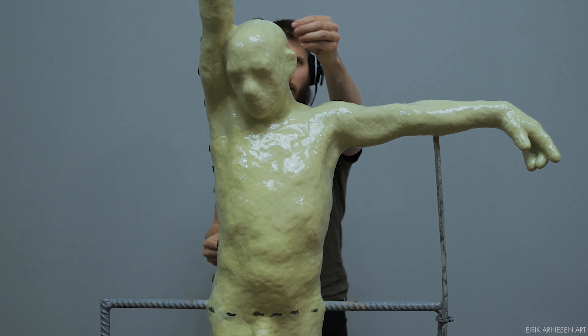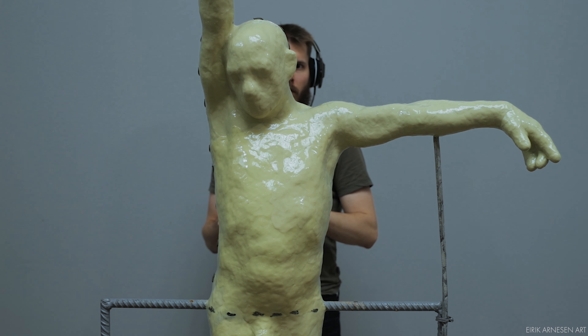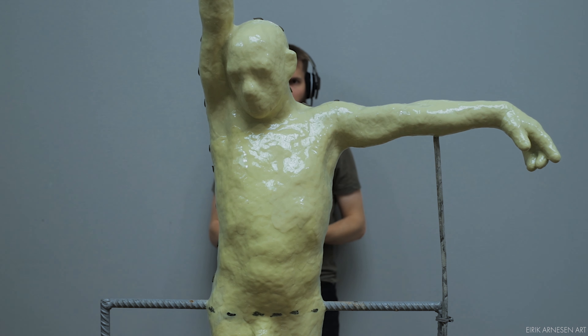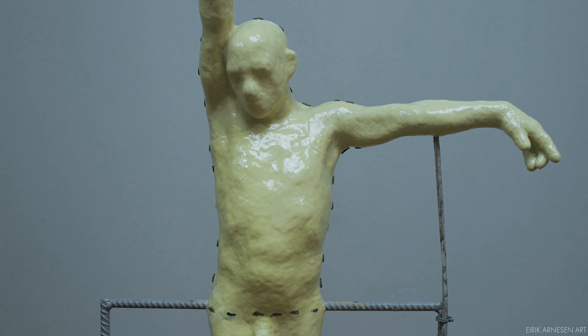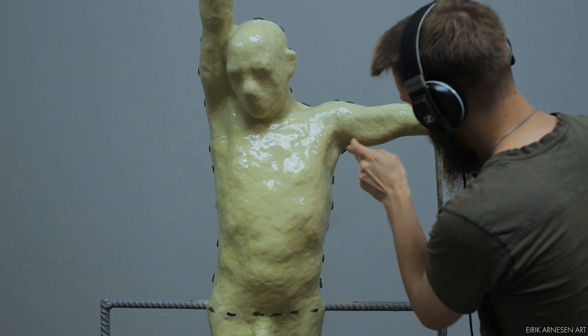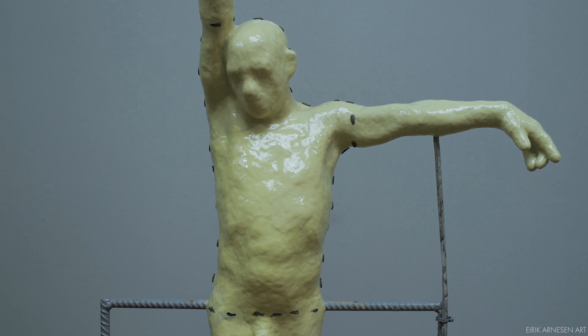To mark the area where I will cut I begin placing small pieces of clay. The pieces of clay are easier to see from this view because they stick out — a marker would be on the surface and tough to see. With all the pieces of clay placed I can step back and observe. If I can see all the pieces of clay at once I know I'm on the right track. If one piece disappears behind the horizon of my figure, I need to move it forward so that it reappears. This gives me a real good visual guide that I can observe from both the front and back, and I can see if my walls are placed correctly. There's obviously a bit of playroom here because if the wall is placed behind the horizon, I just need a few more pieces of mother mold on my front half.